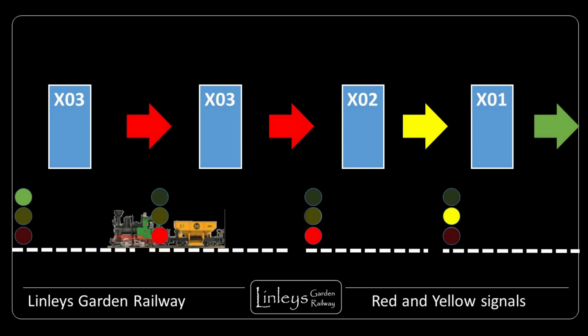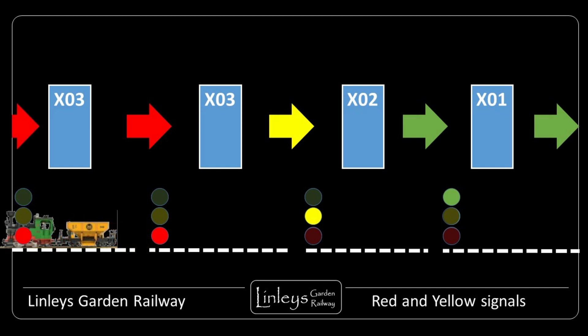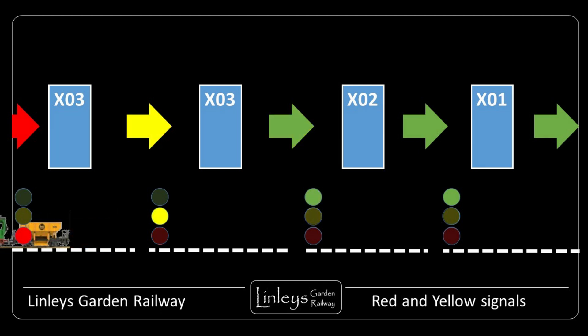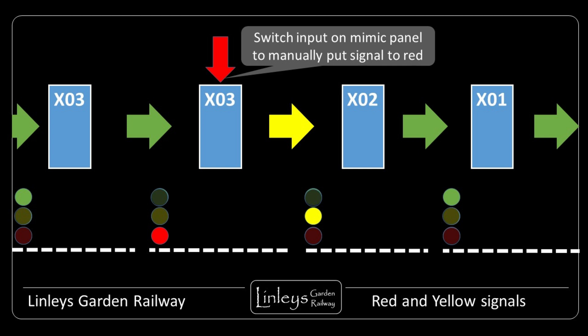As the train moves from X03 into X04, the various block section modules will detect this and the signals will update, moving the red and yellow signal aspects along following the progress of the train. The block sections to the rear of the block behind the train will then be cleared and the signals will be green. Any train which is following will be managed fully automatically to respond to the signal aspects. Trains will stop at red signals and will continue through blocks at caution at slightly reduced speed. At any time a signal can be turned on at a mimic panel, and this overrides the automatic clearing of signals when trains pass - on signals still show correctly with red and yellow aspects to protect a train in section. I hope all that makes sense.